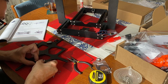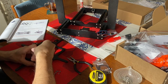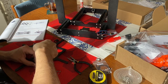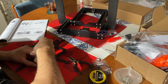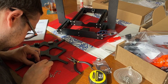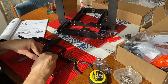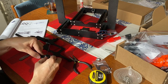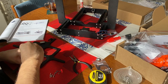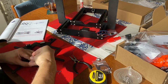So now I placed the 2 screws. Just gonna fix one now. I'll show you on camera how to do it. It's not hard, but you shouldn't tighten them more or less, to be honest. You should use your instinct here. Too much and you will bend the hole there, and too little the bearing will slide left and right, so they have to be tucked in place.